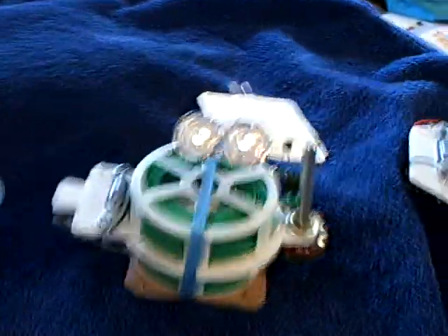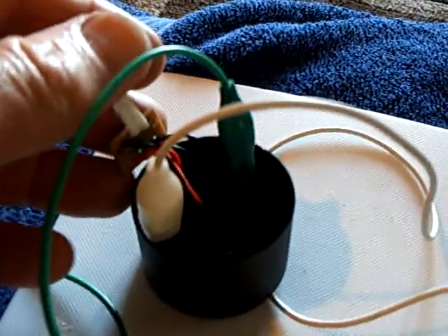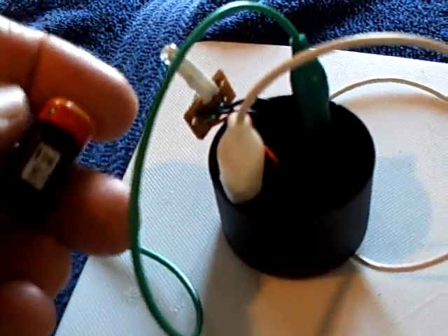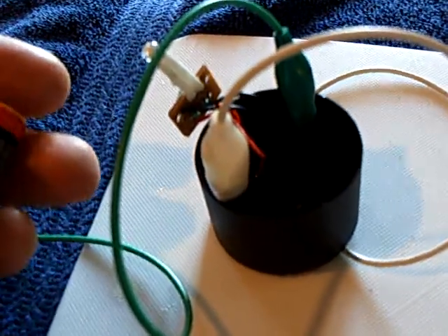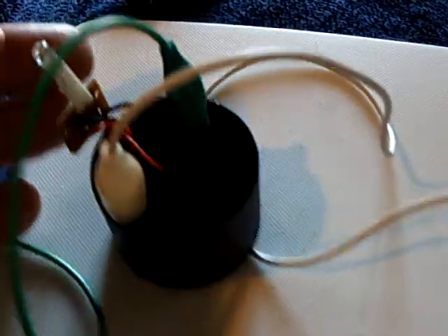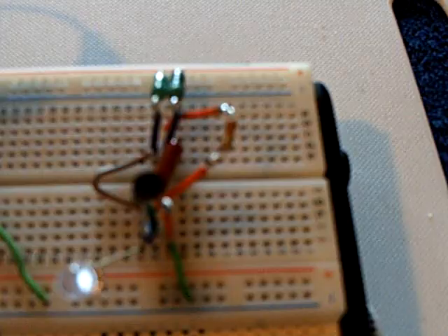I'm still exploring the combination of the oscillator with the crystalline cell. Now that I've found there's another way to make these little blocking oscillators — just using chokes — you could make this very, very small. The circuit in here draws 7 milliamps off of that 1.2 volt NiCAD battery. You could even just take the guts out of that and, if you had a strong enough cell, just use that whole garden light and not even build one of these circuits.